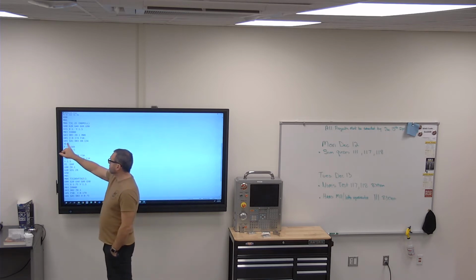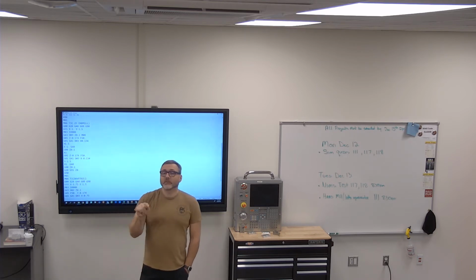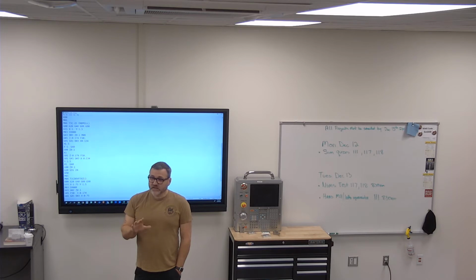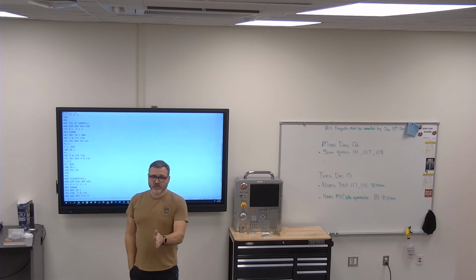So what you're going to do is cut up one side of it with cutter comp on. Cutter comp doesn't work in Z moves, or let me say it like this, we primarily don't do Z moves with cutter compensation on, because it has a likelihood of comping in Z, and you don't want to comp in Z. It knows how it comps by the way it moves. It knows if it's left or right because of G41, G42, but how you move perpendicular into the part tells it which side of things we're on.